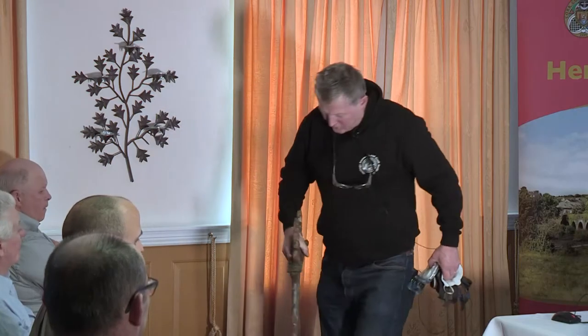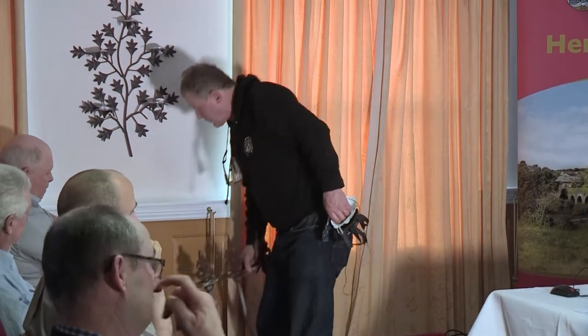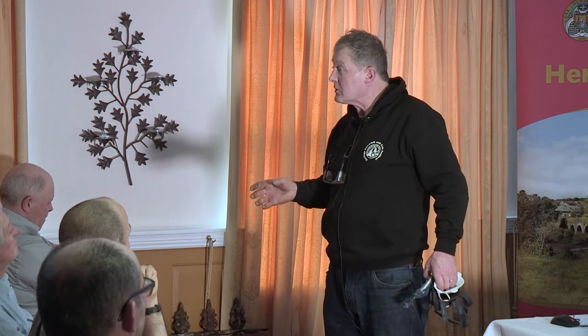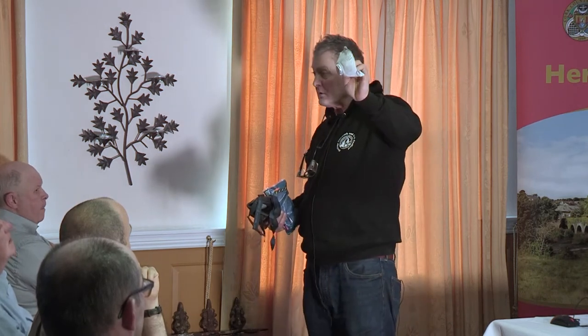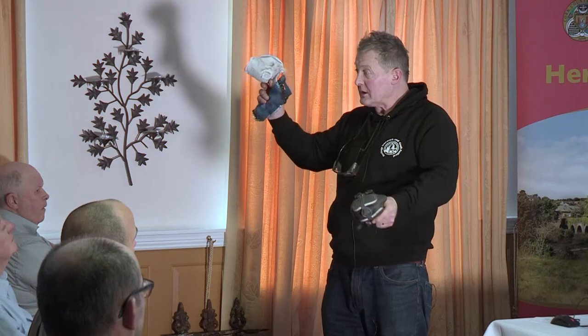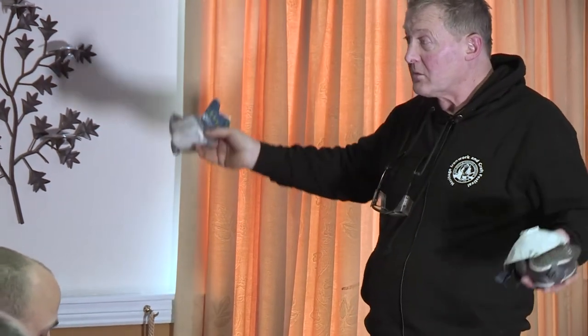I'm going to show you a piece in a minute — it's very old and hasn't been painted in living memory. Any paint that's older than about 1960 will have had lead in it. When you're using the cup brush especially, you're making dust of old paint that invariably has lead in it. You don't want to ingest any of that because lead is cumulative in the body. The old-fashioned masks I don't rate as any good — the molded face masks are far better, with replaceable filters. Way better job. You're worth it.